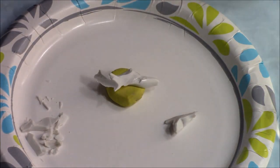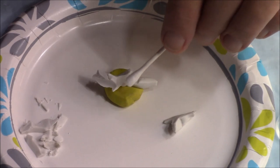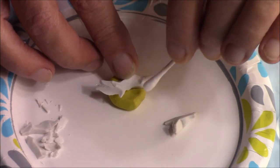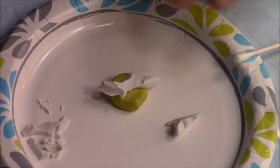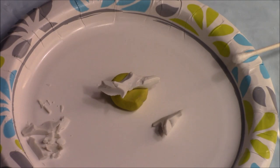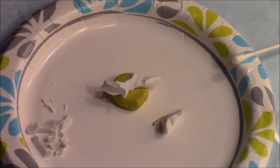So, sometimes this is all you can do in a day is get these pieces together because it's very important to get the alignment exact. If you don't, other pieces will not face up to it and you'll never get it together right. And this particular bonding agent requires zero space. It prefers zero space between the pieces. Works best that way. So we'll come back tomorrow and put this other piece on here. Same process. We'll just use gravity to hold it together. And it's just the tedium of this type of assembly. You just have to be patient, do a little bit at a time, and you get really good results.